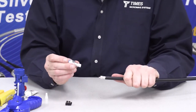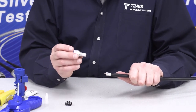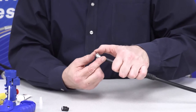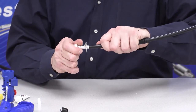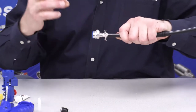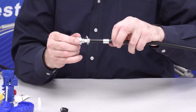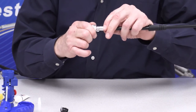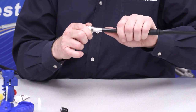Take your EZ connector — it's a gold-plated beryllium copper spring finger, very common. Probably three-quarters of the connectors we sell now are the EZ style. Just fan the braid wires back a little bit, get the connector started — it's a nice snug fit under the cable. Push it and turn it, and you'll feel those four fingers on the pin right up on the center conductor. Take the ferrule, bring it forward, and those braid wires will end up right where you want them — right at the very back of the body of the connector. No braid trimming required.